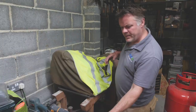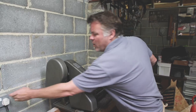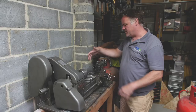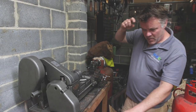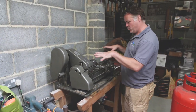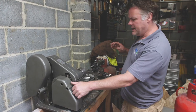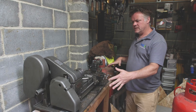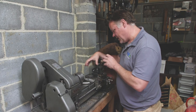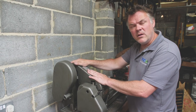We've shown you the old Myford. Because I've got this time, I've been getting into things like this. It's really quiet to run, this is it running, it's very quiet. So I've got things like chucks, we've got a load of collets in there, things to start making this work for us. I've been doing some tool grinding, but currently, again, this isn't where I want it. That shouldn't do that. So that needs stripping down, cleaning and tightening. I think I had an issue with the tension on the belt.